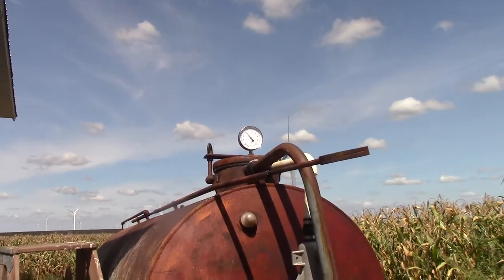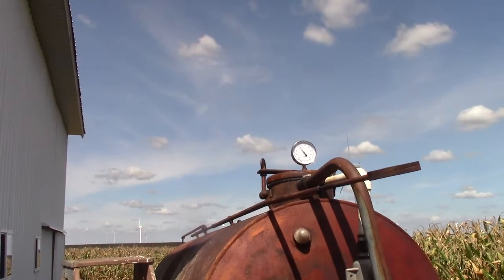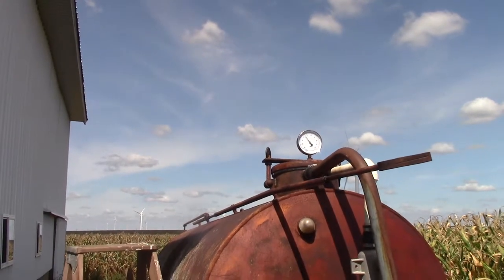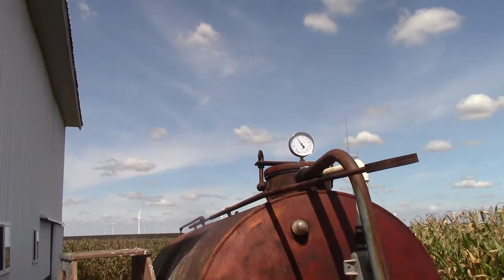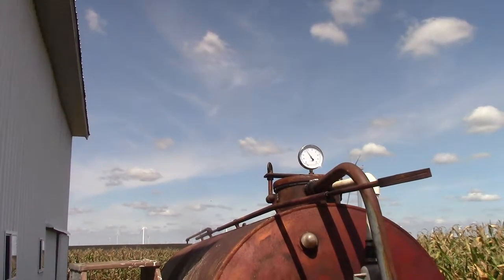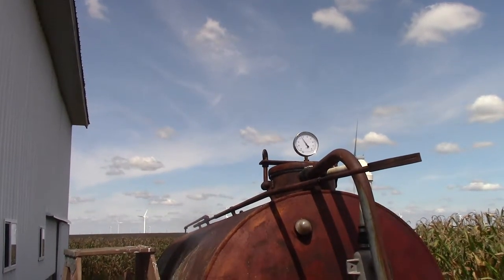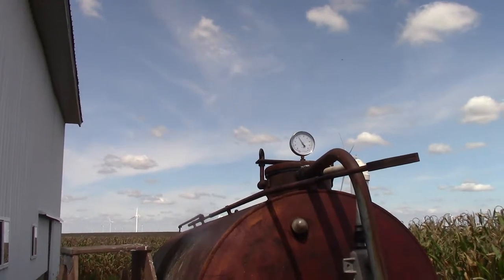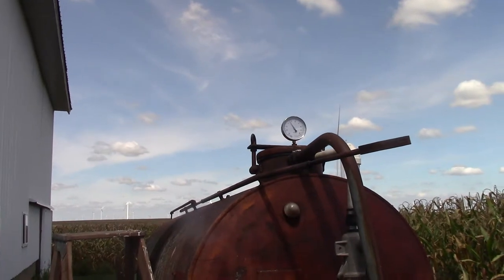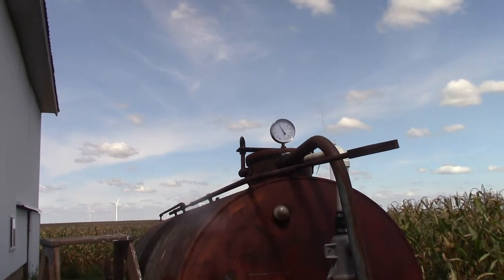Climbing a little bit — about three pounds. If I rev the tractor up more it'll climb faster, but like I say I'm just taking it easy. I don't want to blow out a seal or something. So far everything seems to be nice and tight — I put all new rubber joints on it, which wasn't very expensive and it needed it.